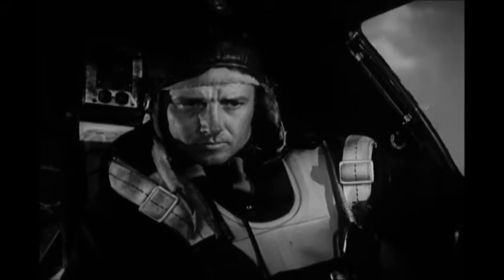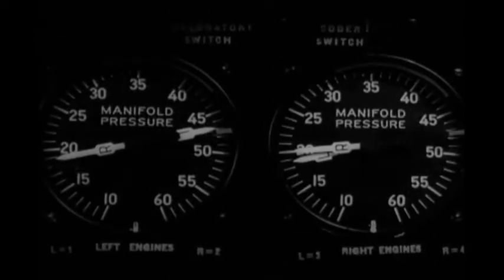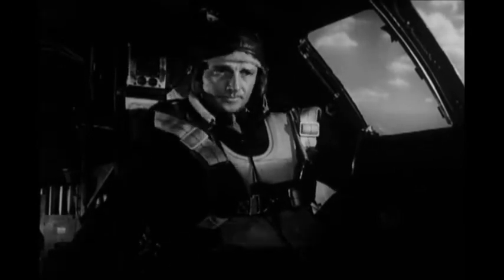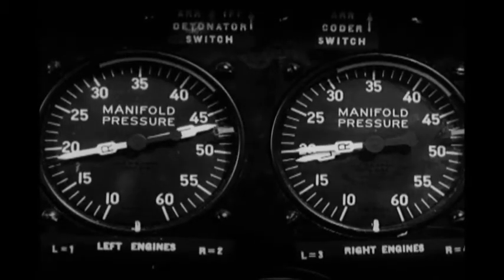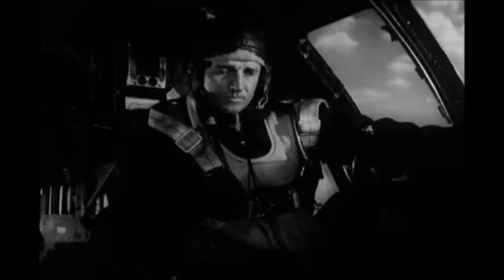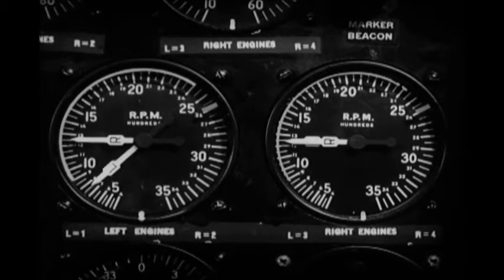The tachometer should show about 2,600 RPM for the number 1 engine, while manifold pressure should be around 47 inches. To see if the turbo is working properly, turn the manifold pressure selector towards 0. That should make the manifold pressure drop. The turbo's okay. Bring the throttle back to idling, around 550 to 600 RPM, and increase speed to 1,200 to avoid fouling the spark plugs.